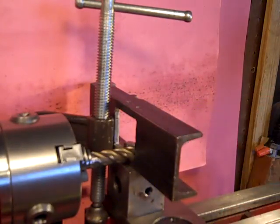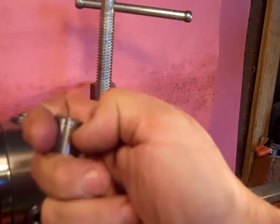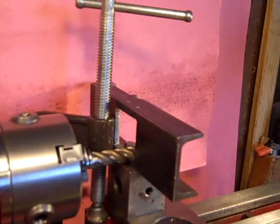I made these rollers. Let me show you a picture of them. I don't know if these are the ones. No, these aren't the ones, but they're like this. 2 rollers. They have little grooves in them, and these are going to roll 22s in here. I'm going to roll across the top with a 22 bullet, or 22 round, to push that crimp in there. So basically it's a crimper. It's a prototype, and I'm not sure it's going to work. I've tried several different variations of this thing, and I'm hoping this one will work, because I really need to set this up.